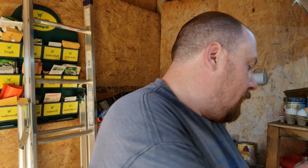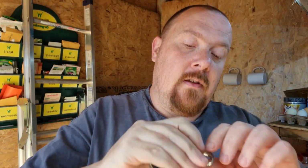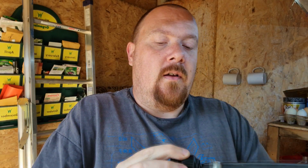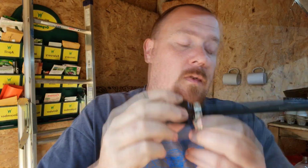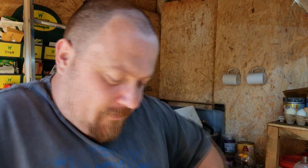These are, oh god, I've not got my glasses on me, so bear with me. These are 9mm, with a 12 to 20mm internal diameter. Now say if you haven't got hot water and you are just doing push fit, it wants to push all the way on, so that wants to be all the way up against the butt, and then you can tighten them on, and don't over tighten them because these things will crush plastic connectors. So let's see if I can get that back out.